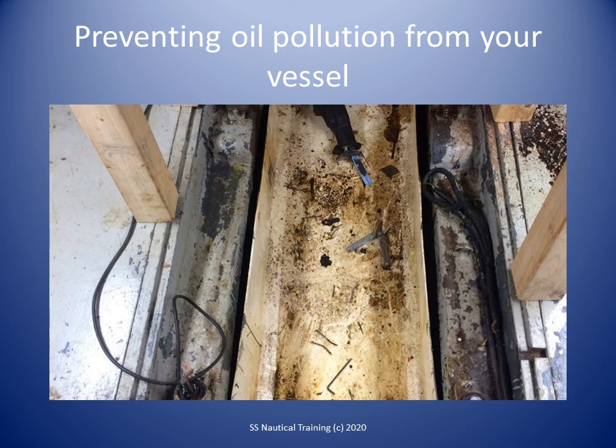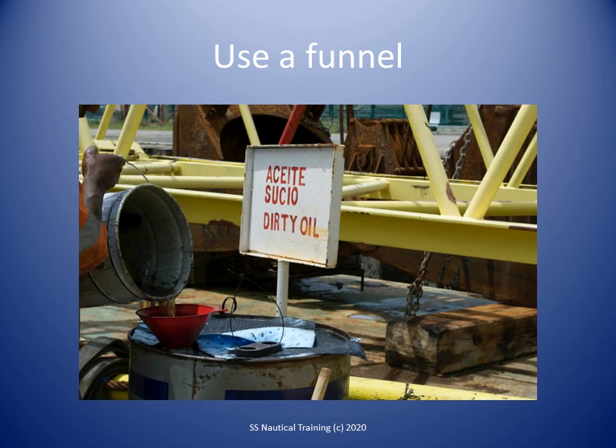An onboard bilge filtration system will filter diesel from bilge water before the automatic pump discharges the water. Using oil-only absorbents in the bilge, securely fastened to prevent clogging the bilge pump or its sensor, will capture unexpected leaks. Transfer and remove fluids with care, using funnels, pumps, and absorbents to eliminate drips and spills and to keep the bilge area clean.